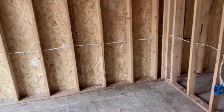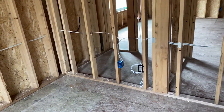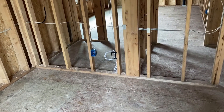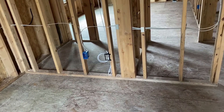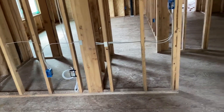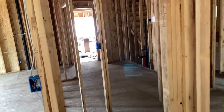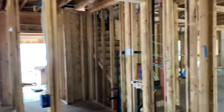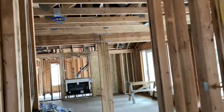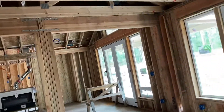That's a typical wiring rough-in on a spec home — nothing crazy, but at least we've got some wires in here for the future homeowner. Every bedroom, master bedroom, and living room all have RG6 and Cat6. It eliminates wireless — if you've got a kid who's a heavy video game user, he's got himself a hardwired network jack and he's not eating up all your Wi-Fi.